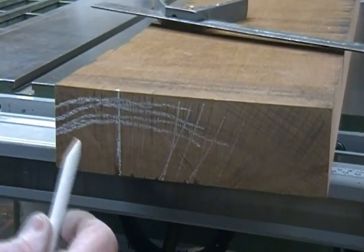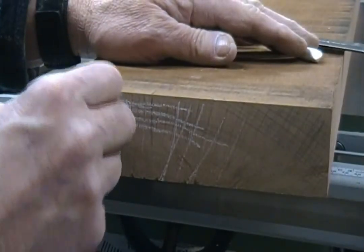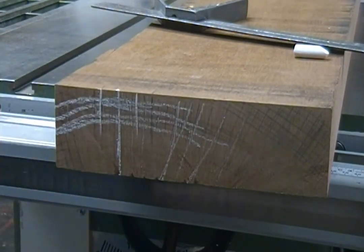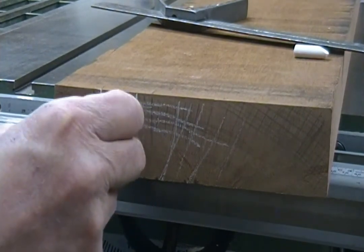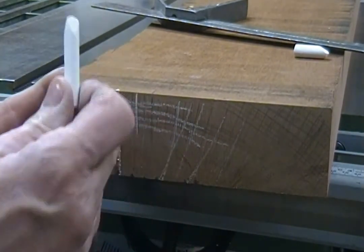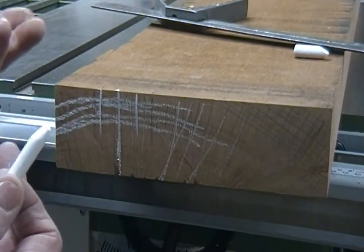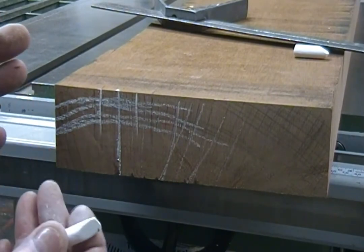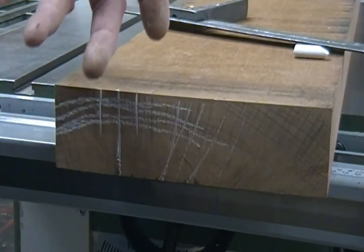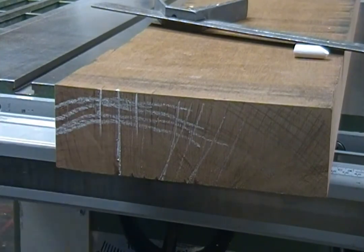The last one is an extra anyway. I've been debating this — I'm going to be over here when I'm done ripping. You can see those lines are still really straight over here too — all really well quarter sawn. The center cut will be my outside quarter sawn boards, so they will be bookmatched. They'll separate right on this line and when you lay them open they would be bookmatched. We bookmatch guitar sides all the time, but it's not as easy, especially on a narrow side — it's not like you can flip the guitar over and really see how well the quarter sawn things line up. But that's the point I'm shooting for.